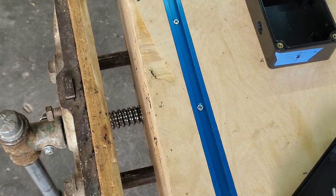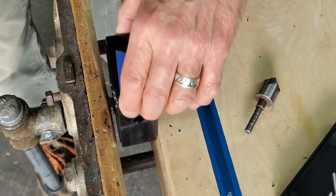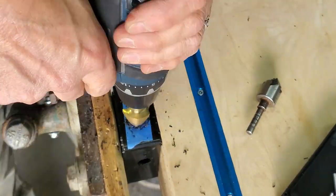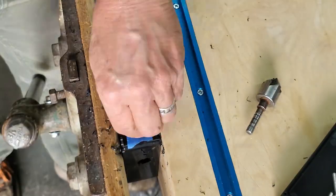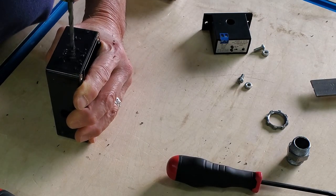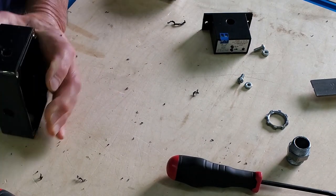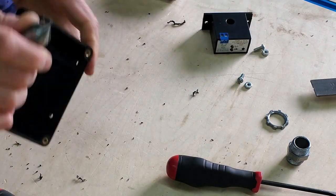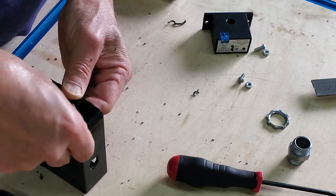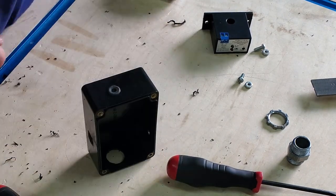A step drill is a better way to drill larger holes in this thin, brittle plastic. The metal coupling will be used to attach this black box to the metal power outlet that the machine is plugged into, and to run a wire to tie into the hot wire that supplies power to that outlet. The smaller hole with the rubber grommet is where the 12-volt DC power will enter.